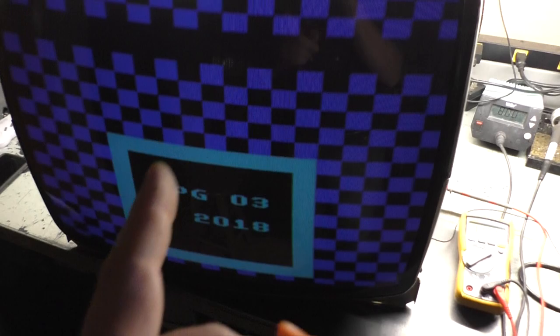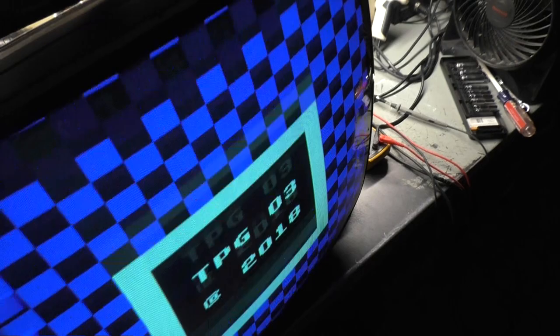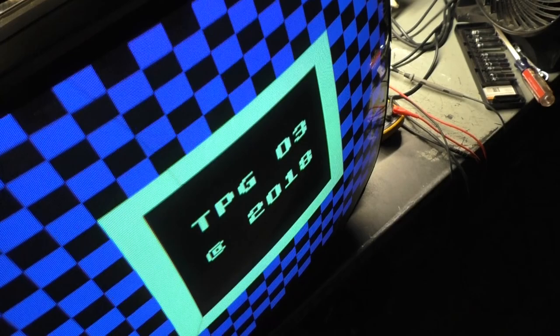Awesome. What about our hold problem? Well, we're stable, but we're looking for this to lock on as soon as I adjust it here. Vertical hold, here we go. Yes! Vertical hold, I'm turning it, and it's rotating. Now, if I go the other way, it should lock right on immediately. Boom! Yes, I'm turning to the right, turning to the right, turning to the right. Wow, look at that. I'm all the way to the right.